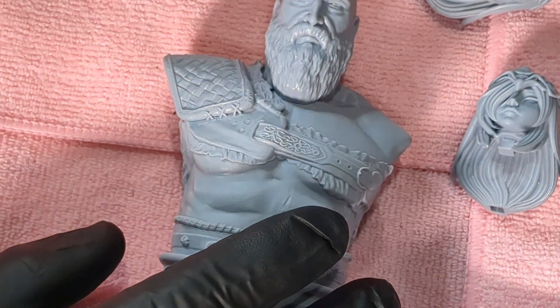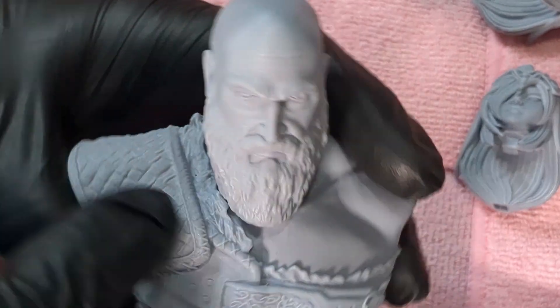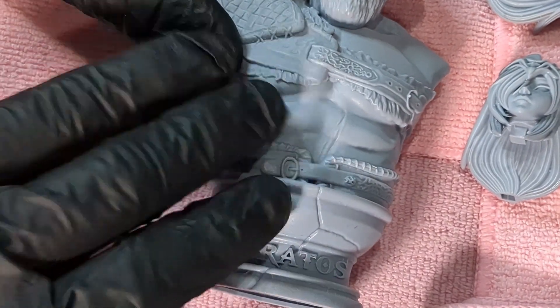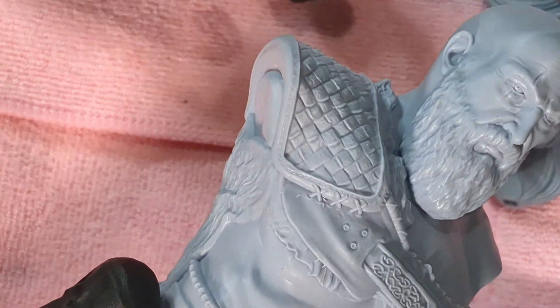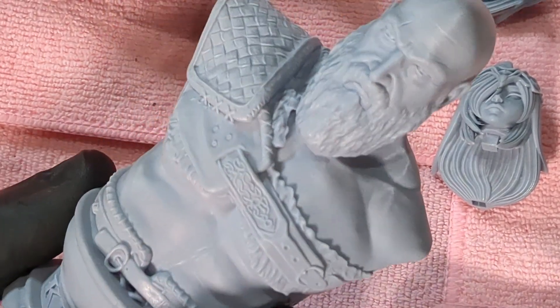Some people argue that aliasing features don't work for their particular printers — this may be true. I did read documentation suggesting that certain resins have a harder time making the aliasing settings work, which could just be a resin quality issue. My final recommendation: use sharpen details level 8 or higher with a 30–50% gray offset, or smooth surfaces with a one to two pixel radius depending on your layer height, also at 30–50% gray offset. Hope you guys liked this one — see you soon!